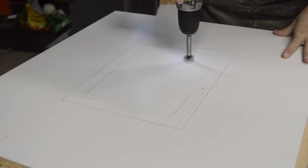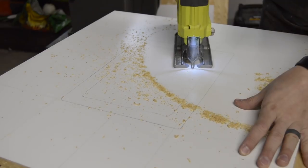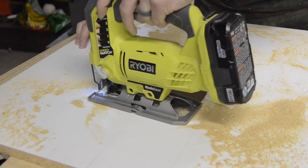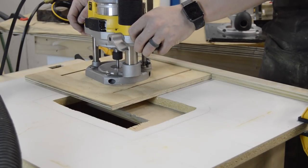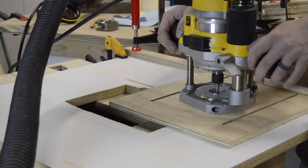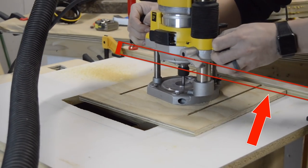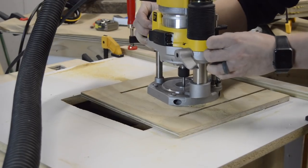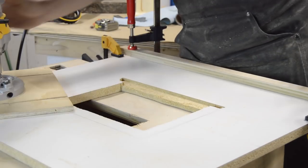The next step is to cut the hole for the router plate insert. After tracing the insert outline onto the center of the melamine, I cut a rough hole an inch or so inside the line with my jigsaw. Next I installed a spiral upcut bit on my plunge router to cut to the actual trace line. I carefully set the maximum plunge depth to the thickness of the router base plate so that it would end up sitting flush with the surface. I clamped a straight piece of plywood to the edge of the melamine parallel to the pencil line at just the right distance to ensure a nice straight cut. I was very careful approaching the corners of the pencil outline so as not to overshoot the end. After the outer edge of the cut was complete, I just freehand routed out the remainder of the one inch overhang.